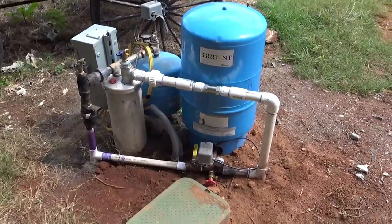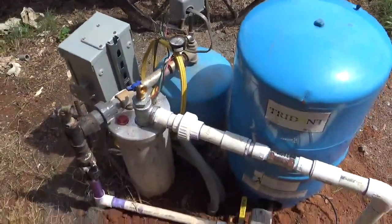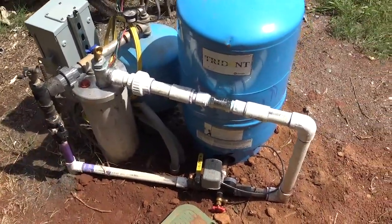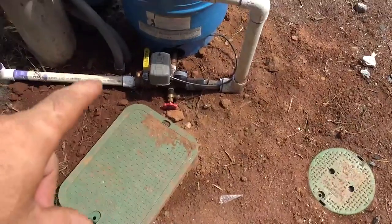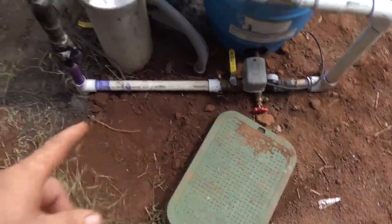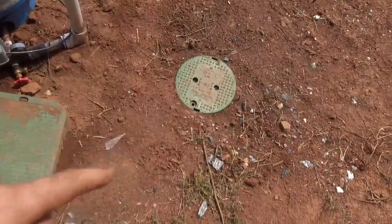They have some irrigation and think they need pressure, but a lot of volume helps too. At the well there was some existing plumbing with a little bladder tank and pressure switch. I removed the well seal, added a new well seal that accepts another pump with inch-and-a-quarter drop pipe and plumbing. I added a separate bladder tank and separate controller for the Grundfos pump, plus a bi-directional valve that allows the grid pump to charge the entire irrigation system or keep it on the solar pump. I added a master control valve to isolate all of this from the tank on the hill.